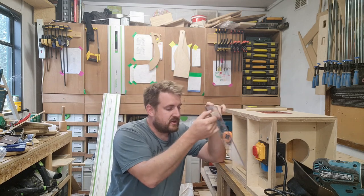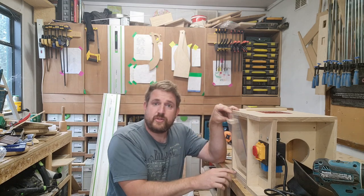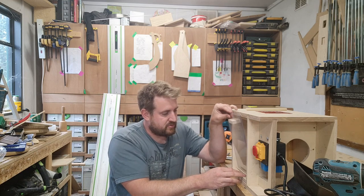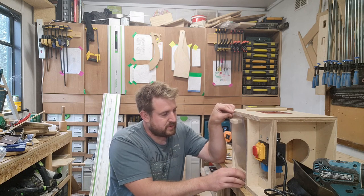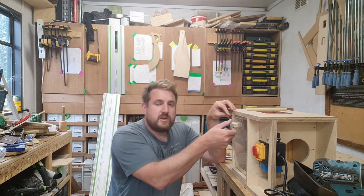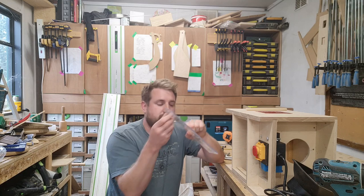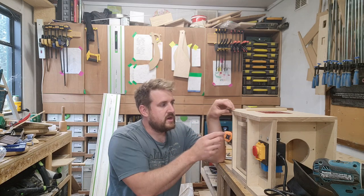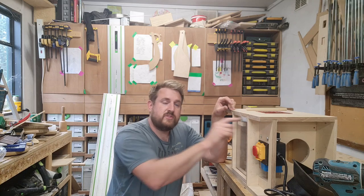size, and it fits in nice. And then what I've done is I've made a slot at the front here, just two pieces of wood. One of them I've done birch ply on edge, so it looks the same as what's below it, and that just needs gluing on. Made a little handle on top of the piece of perspex, just a hole and a screw for it, and that pushes back against the stop on the inside.